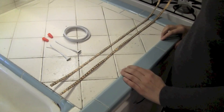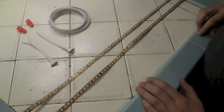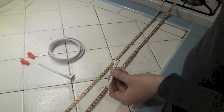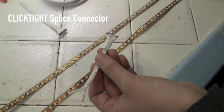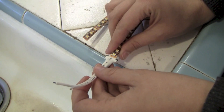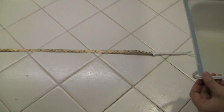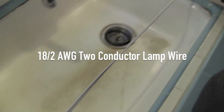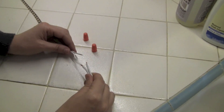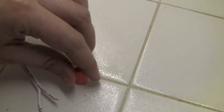You can also use strip lights just as easily as light bars, and for that you'll just need to use different accessories. You'll use an LED strip light splice connector and install that on the end of each piece of strip light. We're going to use an 18-2 lamp wire to connect these two pieces of strip, and we sell this lamp wire by the foot. To make a secure connection between the lamp wire and the splice connector, you can use a wire nut.